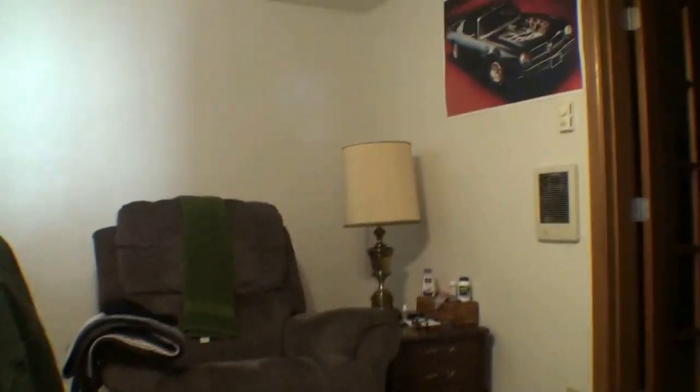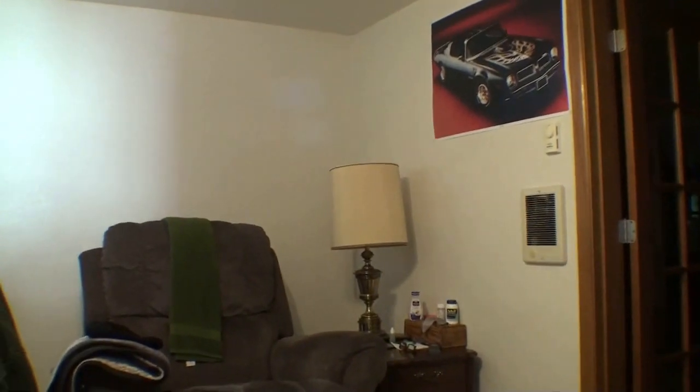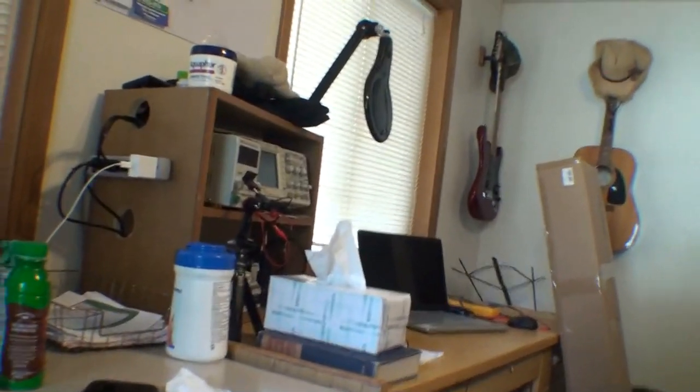Like, I got another problem just because I'm yakking away. That light right there is a three-way light. You click the switch once, low, again, higher, and higher means brighter. But for some reason, it's not working. I tried a new bulb, it's not working. So I'm assuming, again, like a car, it's got power, the light goes on, so it must be the switch. It could be the switch down below, or I'm looking at the light, or it could be where it plugs into the socket.